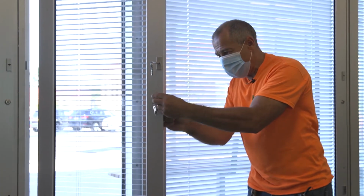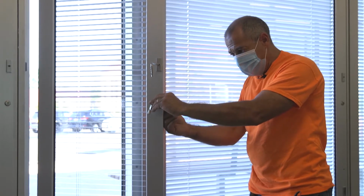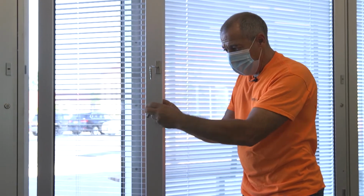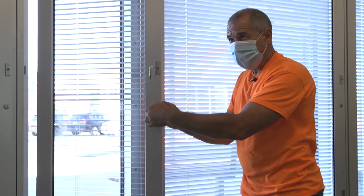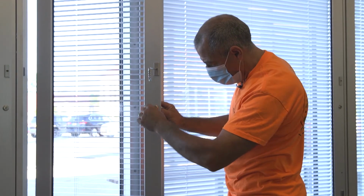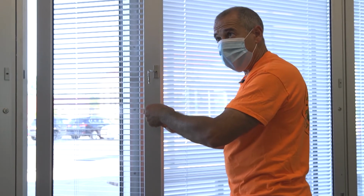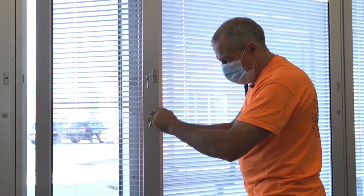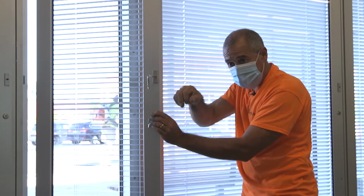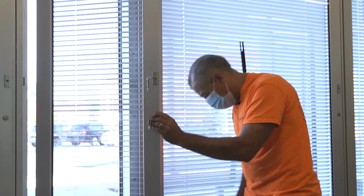But you just want to make sure when you put the gem lock back together that the stop tab on the lock is at the bottom. It throws so that the key stays in the locked position. These gems only have one locked position where the key won't come out once it's under that spring pressure that it has. Mm-hmm. So it's basically that stays there so that this stays in when it's unlocked and you can function the door opening it without it falling out.